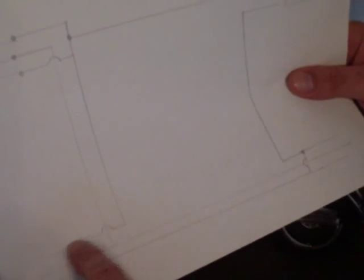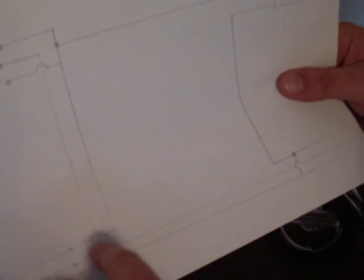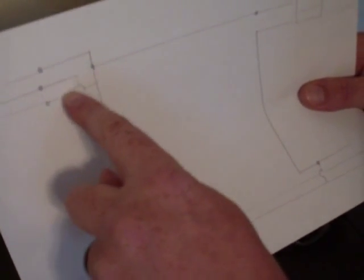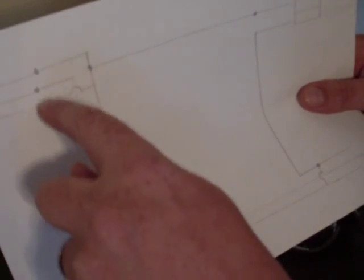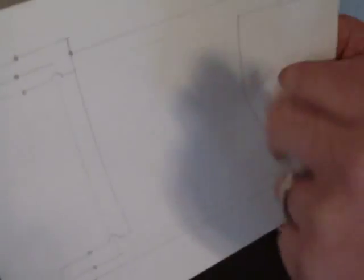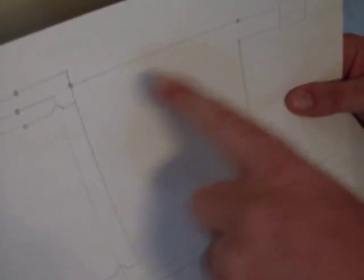And the left-hand channel from the input, it goes up to the output, the master output socket, and again, I've bridged the left and the right pins to create a two output mono, so left and right channels are both supplied with the same signal.